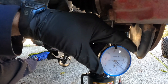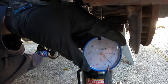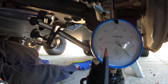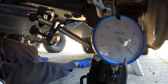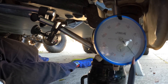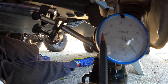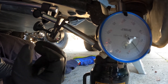Let me show you the dial. You can move this bezel and you want to zero it out, so you want to get your needle right on the zero. We can go up to 40 lines of movement. When I count from the zero, in between each of the bold numbers — between the 5, the 10, the 15, and the 20 — there's 10 lines. So I can go from 10 to 20 to 30 to 40. I can go all the way to the bold 20 number and that will be 40 lines.